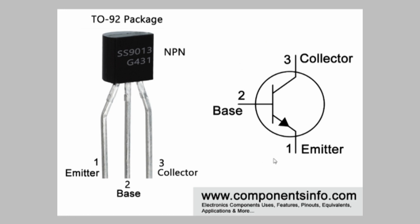Now, a transistor is basically just a switch, so when the base is high, then current is allowed to flow from the collector to the emitter. And when the base goes low, no current is allowed to flow from the collector to the emitter. And in our case, we're using 3.3 volts. So our collector is going to be connected to 3.3 volts. We're going to connect the base to one of the pins on the blue pill. And the emitter is going to be connected to one of the power inputs of each character on the display